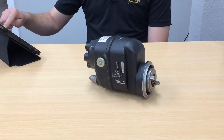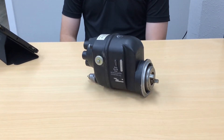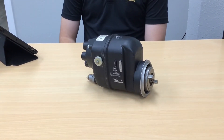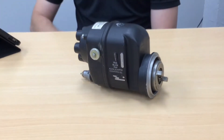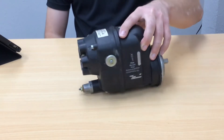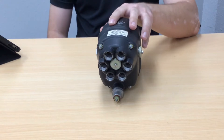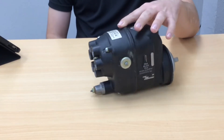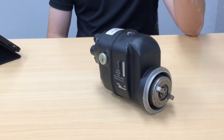If you dive deep into the documentation on our engine, the Lycoming IO360 L2A, you'll find that we have two Slick 4300 series magnetos. The magneto I have here is also made by Slick, but this is a 662. You'll notice on the back we have six leads instead of four. This was used in six-cylinder engines, some of the Continental O-470 and 520 variants, but the operating principles are exactly the same.